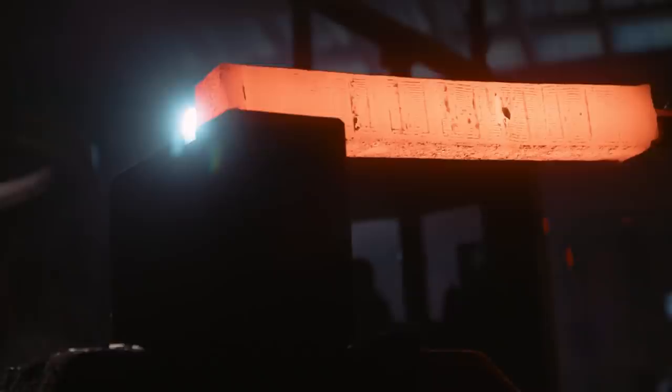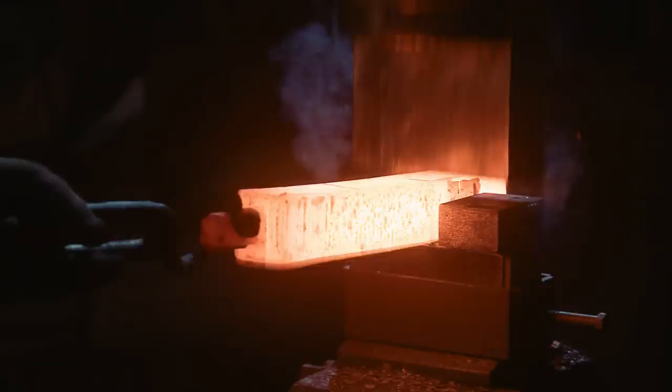The guys now go over to the Nazel 2B. We've set that up with a kiss block. That's going to prevent overreaching of the die and forcing the material to be smaller than what we need it. We've got to have this exact size so that it'll fit into the twisting machine that Rob calls the Screwcifier.